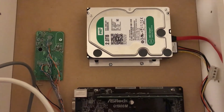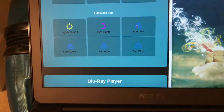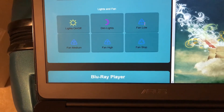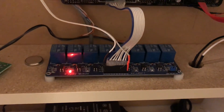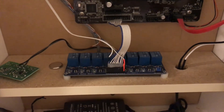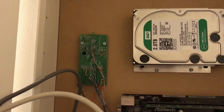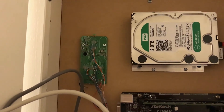On the left is the actual insides of a remote control for the fan and lights. So for example, if I go to my server's web page I can turn on the fan to a low setting, and when I do so you'll see that light come on. The LED indicates the relay is active, and when it is active it closes the circuit to this controller here, which sends a wireless signal down to the installed fan and turns on the fan.